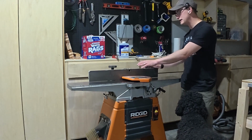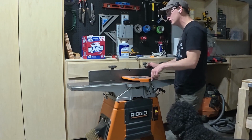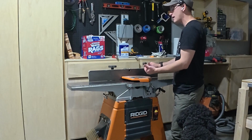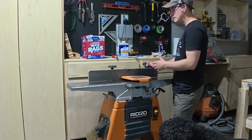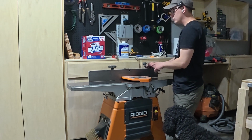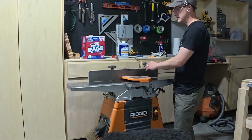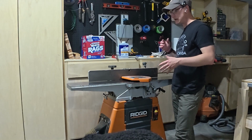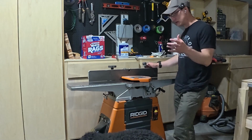Okay, then we replaced our blades with brand new ones, straight blades. We used our Jointer Pal, affiliate link in the description down below, to align our blades to the outfeed table so they move that straight edge about 1/8 of an inch every time we spin the cutter head. And then finally, we made sure that our fence backstop at 90 degrees was accurate, so that every time we reset this fence to 90 degrees, it's 90 degrees, and we're able to get that perfectly square edge to the surface of our workpiece, which is a lot of what a jointer is used for.